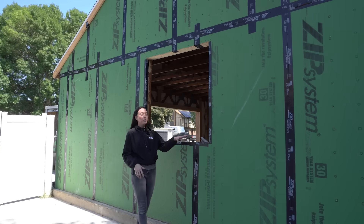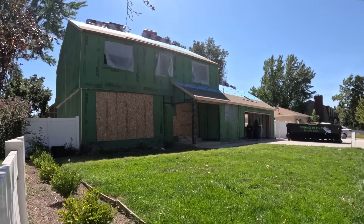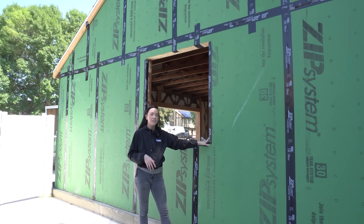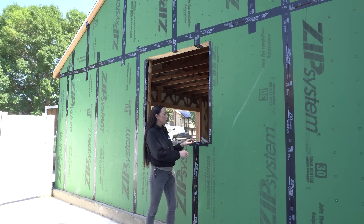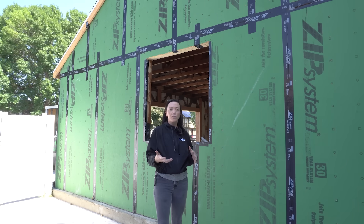Here on the garage side, we've started using zip tape on all of the door and window openings. We had these covered in OSB just to protect the home from people breaking in and critters getting in or out. Now that our windows are being delivered today and we're installing tomorrow, we're pulling those off and getting everything prepped. In addition to the zip tape around the openings, we'll use Zip's stretch tape in the corners to cover any gaps between the vertical and horizontal tape — that's very common. We've also added a whole new electrical service panel to this house, and we've done something unique there to keep water out.